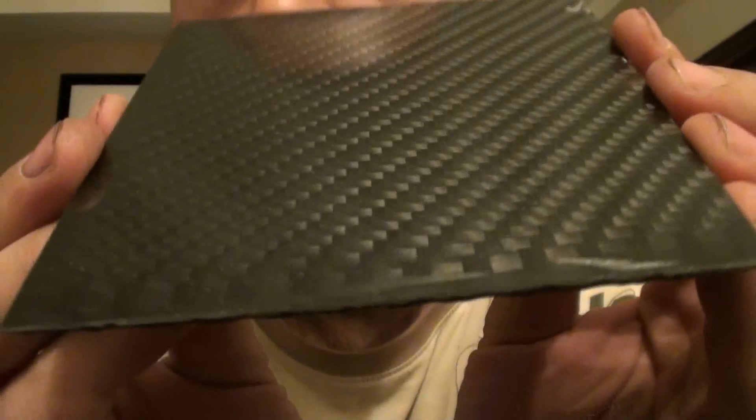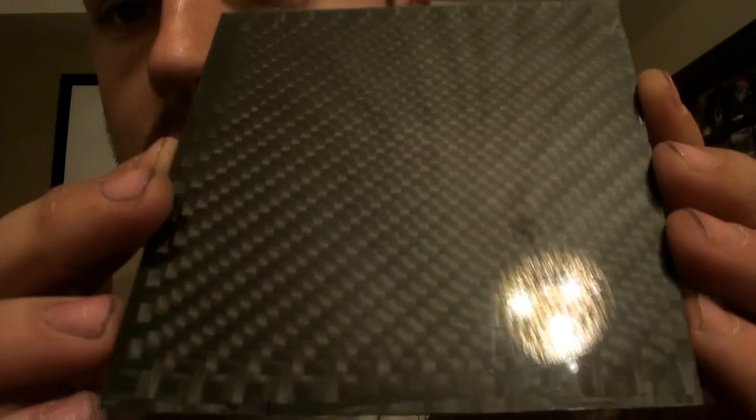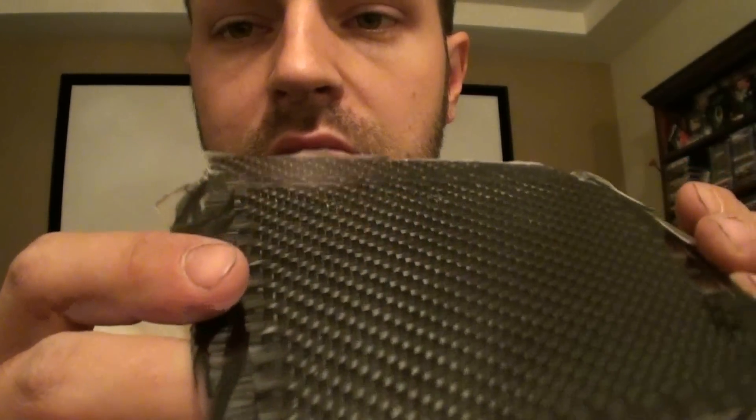All of these pieces have a very good finish — no dry spots, no big air bubbles. However, if you look very closely there are a few very, very tiny air bubbles, but you have to really look closely to notice them. I believe if the resin was warm when I sprayed it, this wouldn't have happened — next time I'll try warming up the resin, which should spray much thinner and all the bubbles will just float to the surface and pop. By comparison, this is one of the pieces I made the other week — you can see all these dry spots. This had no gel coat, I just brushed it on, lots of dry spots and bubbles. I didn't use a roller on this one, and it's much more flexible.